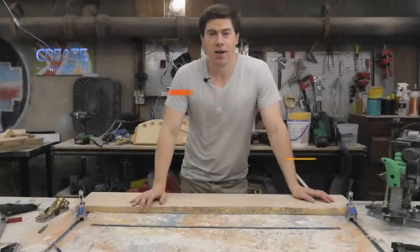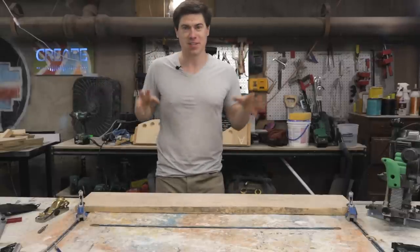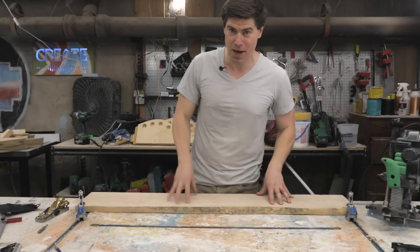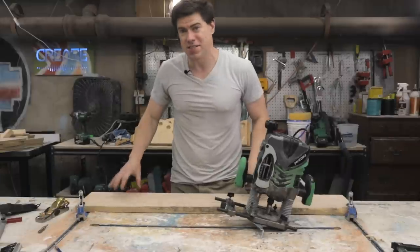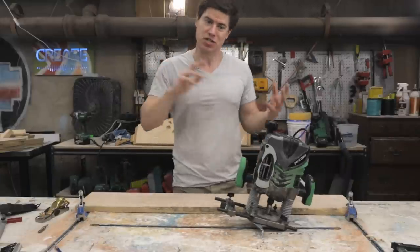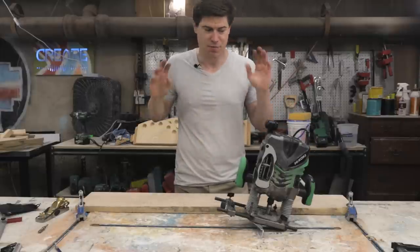It's been a long day and I'm sweaty, but all good. It's now time to route out the channels for the LED strips in this piece of maple. I'm going to use a plunge router, and I'll do it while the wood is still flat before bending — I'm not even sure how I'd cut an even channel down the middle of a bent piece of wood.